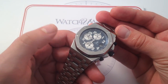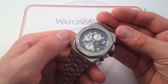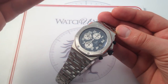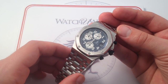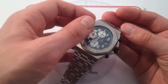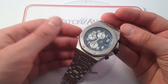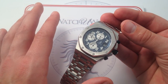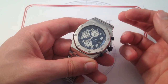As built by Dubois Depraz, you get that chronograph action associated with watches like the contemporary six-digit Rolex Daytona with its vertical clutch, or Blancpain powered by the famed Piguet 1185. But you also get the manufactured provenance of Jaeger-LeCoultre in the base movement. Long known as the watchmaker's watchmaker, Jaeger-LeCoultre has built base movements for Audemars Piguet, Vacheron Constantin, and Patek Philippe. You're getting everything from the original design parentage, the Offshore evolution, Audemars Piguet's standards of fit, finish, and materials on the case and bracelet, the finish of the movement, Stern Creations in the dial, Dubois Depraz building the chronograph module, and Jaeger-LeCoultre building that base movement — shielded by an anti-magnetic soft iron Faraday cage and finished to Audemars Piguet's exacting Vallée de Joux standards.